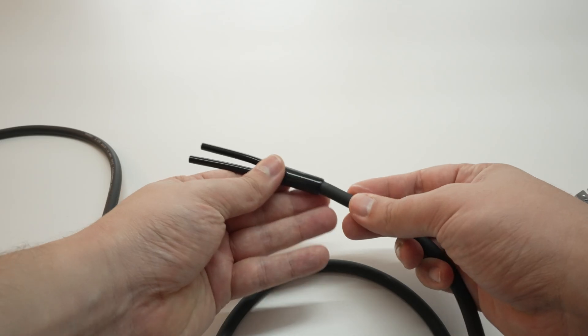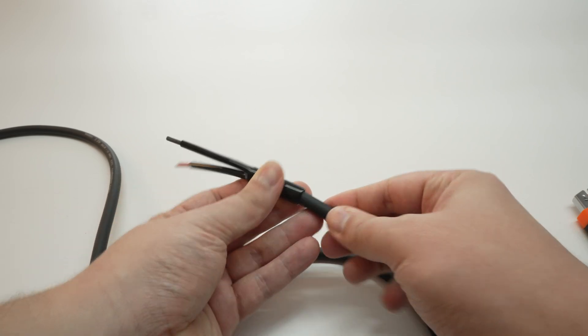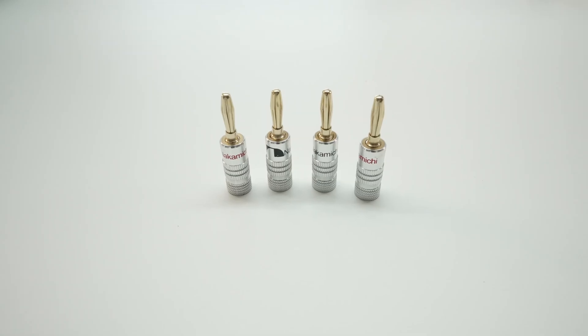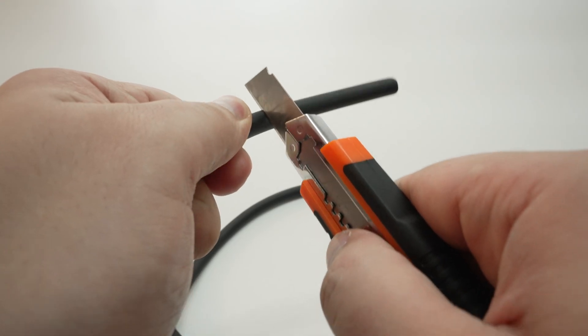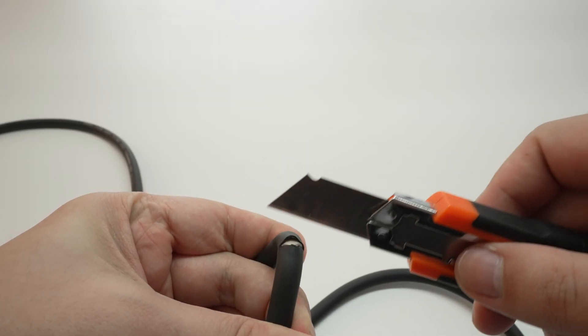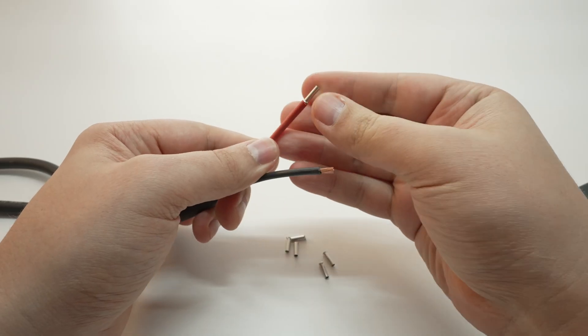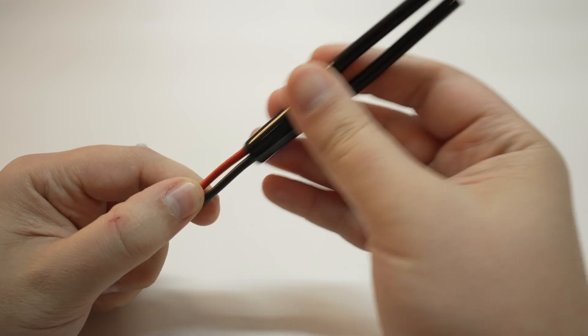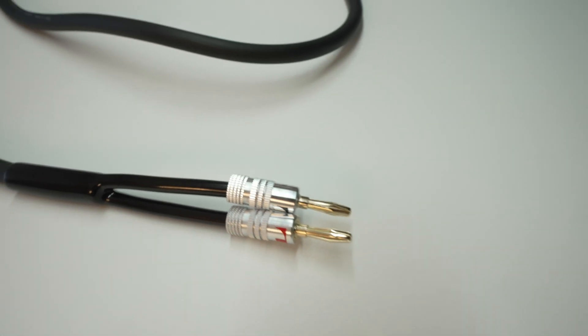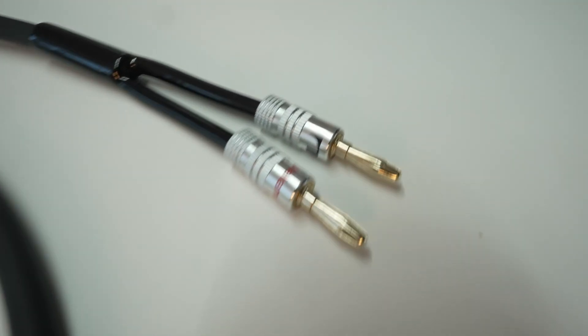Next up we have the 2.5mm wire. Since this has the extra insulation, it fits snugly even without the sleeve. So I'm going to make two cables — one with and one without. You decide if you want the sleeve or not as it's basically for aesthetic purposes only. For the one without the sleeve, we are using the Nakamichi banana plugs and the procedure is basically the same as before. Remove 75mm of the extra insulation — take your time so you don't cut the actual conductors. Remove 6mm of insulation, add the ferrule and snip the excess. Next, put the cable pants — 10mm this time — and simply attach the banana plugs. This is how the 2.5mm cable looks without the sleeve. The thicker cable matches better with the banana plugs and it looks pretty neat even without the sleeve.